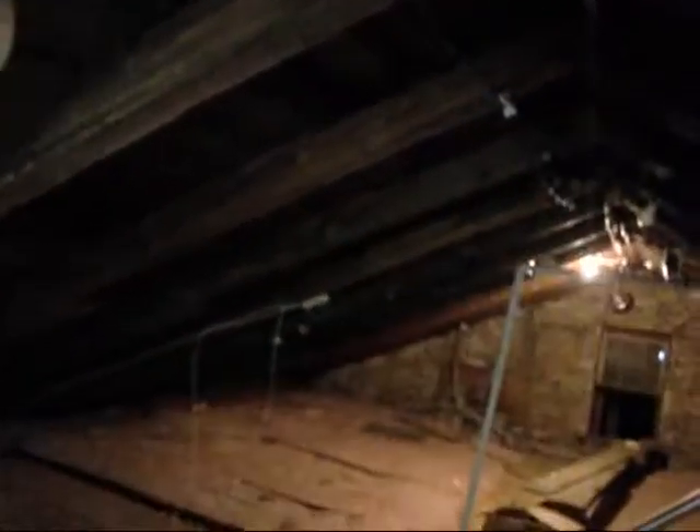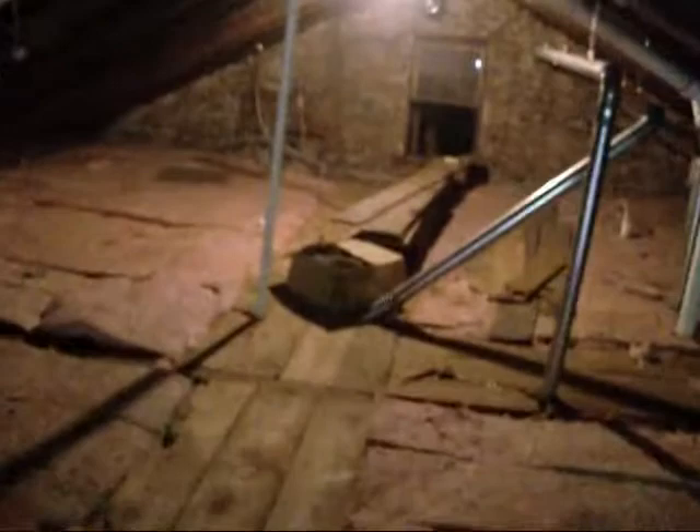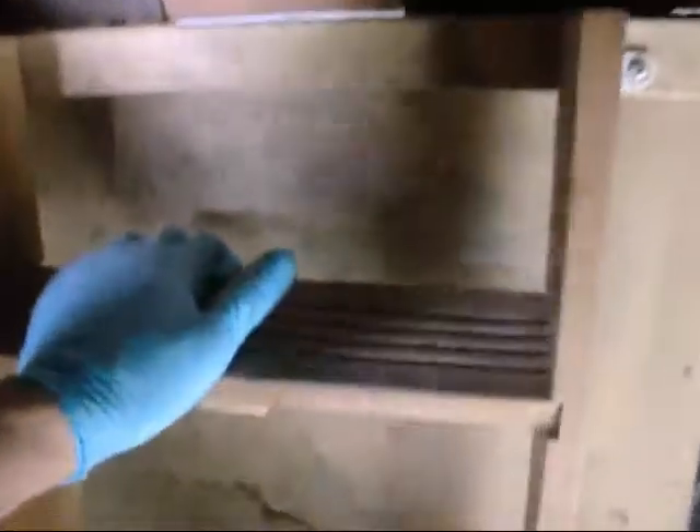Alright, I gotta go eat breakfast. I can't believe all the light bulbs are burned out here — somebody must have been up here and left the lights on. The old wooden shingles, no ridge cap. Knob and tube wiring — nothing wrong with it. They used heavy gauge, 12 gauge wire, soldered connections, triple wrapped. Nothing wrong with knob and tube wiring at all. At least now I have a way to get in the attic — just gotta change that bolt one day. Got a lot of projects; it never ends.